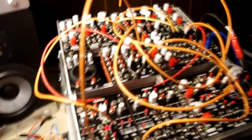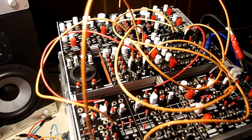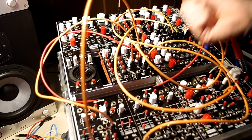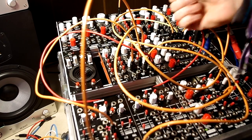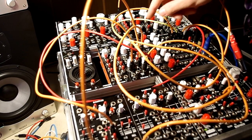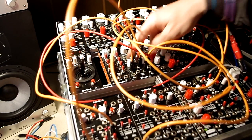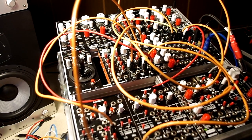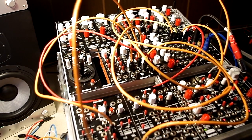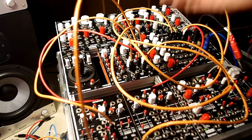The Crash Delay has feedback with a level-controlled volume, so it never gets too crazy. You can play confidently because it never gets really wild - there's a compressor inside. You have a drive, wet, and speed control, plus the volume for two inputs with voltage-controlled volume. There are two VCAs inside to control the volume of the inputs, so every parameter is under voltage control.